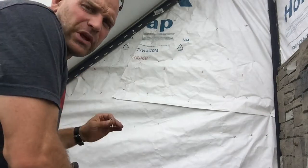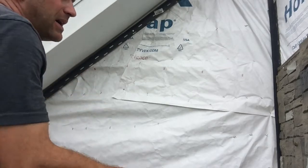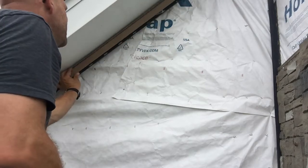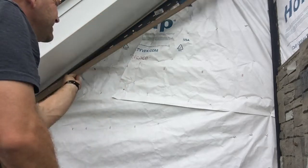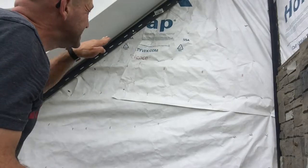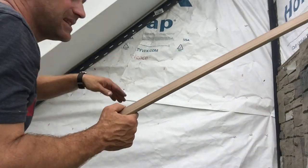I'm going to keep that quarter inch spacing in here so that my cover piece for my trim has a chance to get up in there and lock over that angle cut. It'll look really nice and I won't be fighting getting these little clips into that spot.